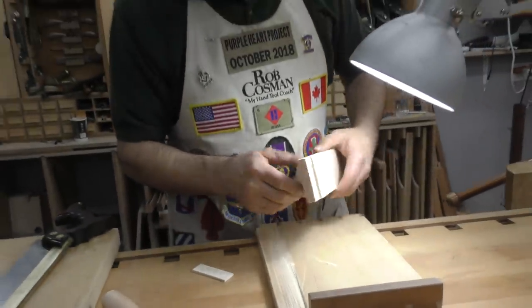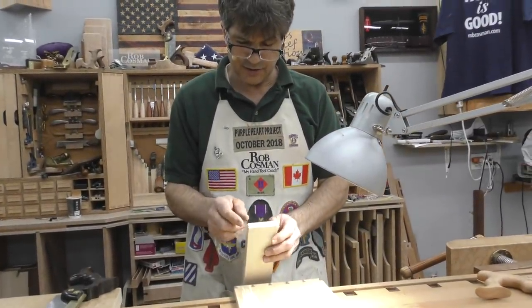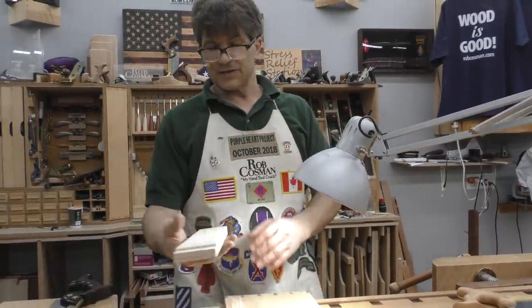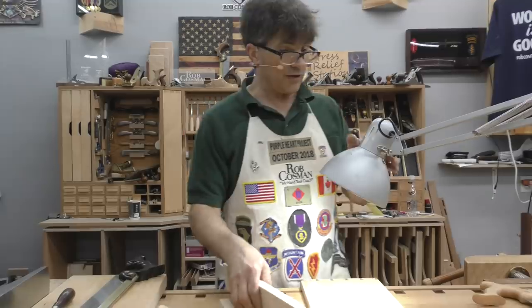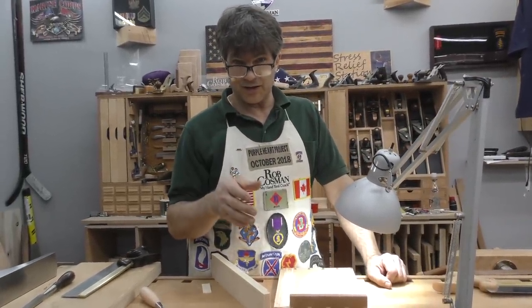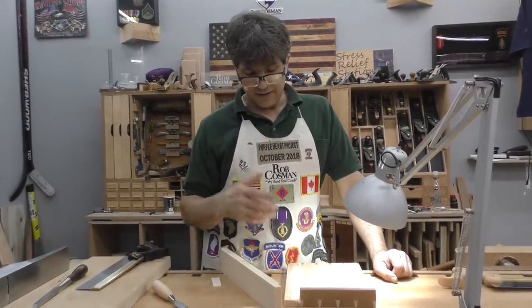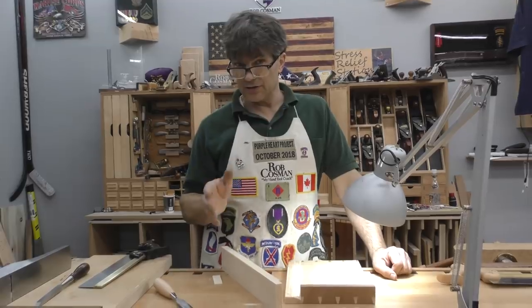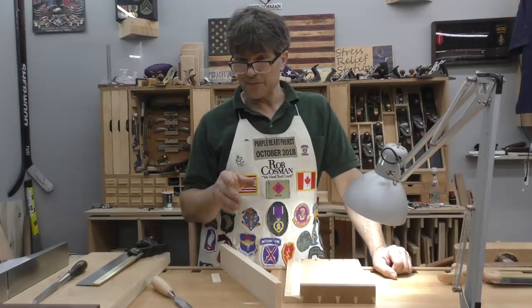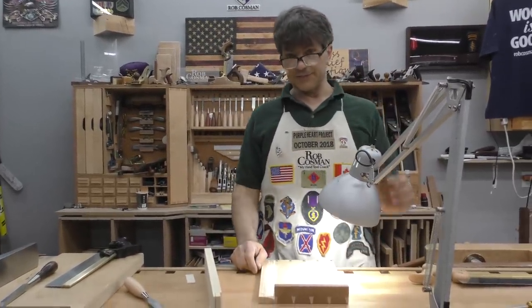I would go ahead and cut this one off, then come in and make my cuts on the ends to cut that tenon down to the exact length that we want. This is a piece of softwood by the way. And if you want to get good at this, practice in a piece of wood that is soft enough that you don't have to put a lot of effort in to push the saw — which allows you the opportunity to practice more with control. You have got to get the control down first. You need sharp tools. The sharper the tool, the less effort is required. The less effort you have to apply, the more control you have. That is the winning formula for getting a really good joint.